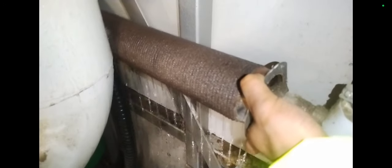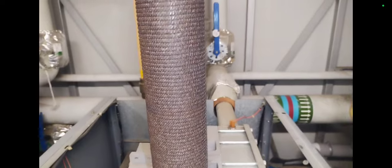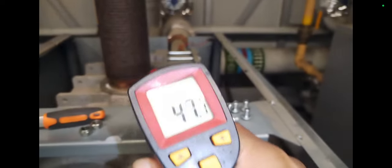What methods do you use to wash your burners down? Some people use compressors; others use water and vinegar, 50-50. The top of the heat exchanger was very hot, so I used that to dry the unit. You can see the heat coming off the unit even though it's off. This is it now when it's been cleaned.